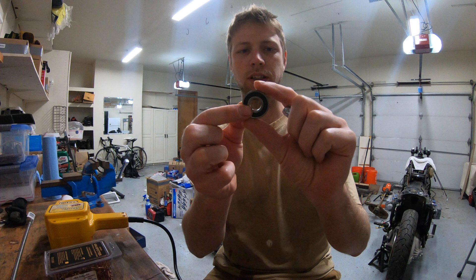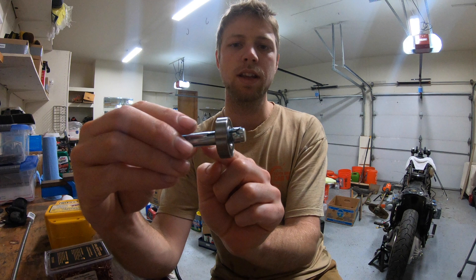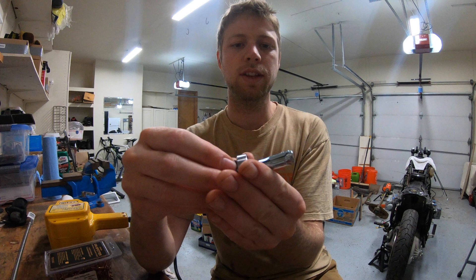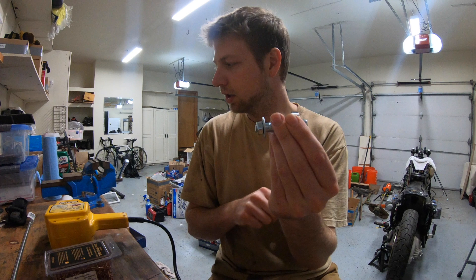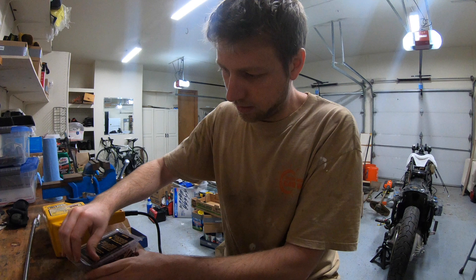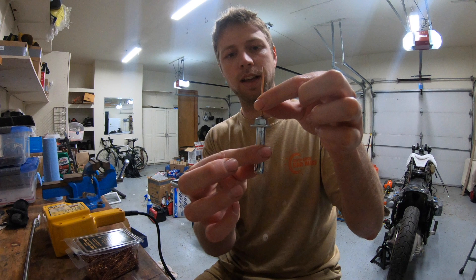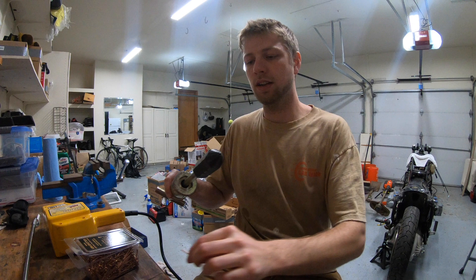So here's the plan. I got the bearings inside the other wheels, and I got these concrete bolts — the expansion bolts. Now it fits through, and the idea is that as I screw this nut down, this sleeve pushes further and expands like that, so that after it's expanded, I can't pull that out. So the question then is how do I pull this out when this bearing is so tight in the wheel? I'm going to use my stud welding gun to weld on a stud, one of these suckers, right onto the end here. And then I will attach this here and, you know, hammer — boom, boom, boom.